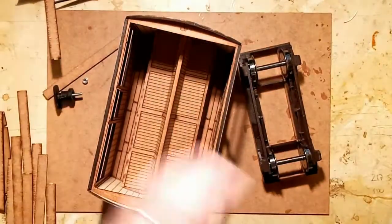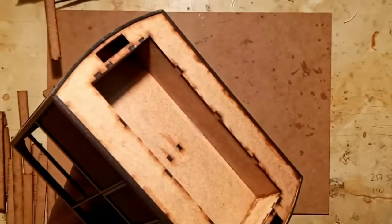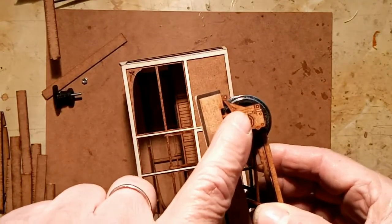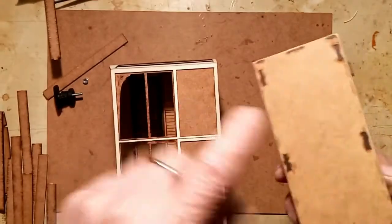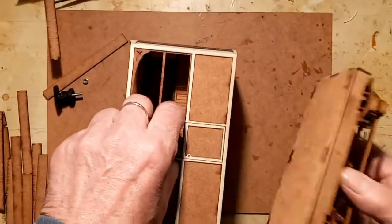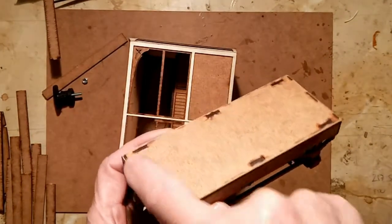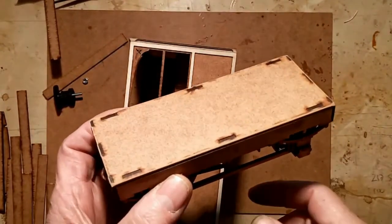Right, next task is to fit the undercarriage. Now this, as we tried before, slots into the opening underneath. When it slots in, it slots in until the axle box is there, the tops will rest against the edge there, and also this surface here will touch this surface here. So first thing to do is to make sure we have a slight radius all the way around there. So just go over with a bit of sandpaper or emery paper just to take the edge off the corner,